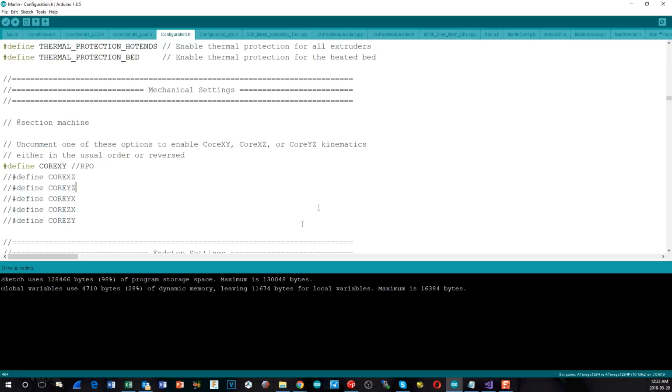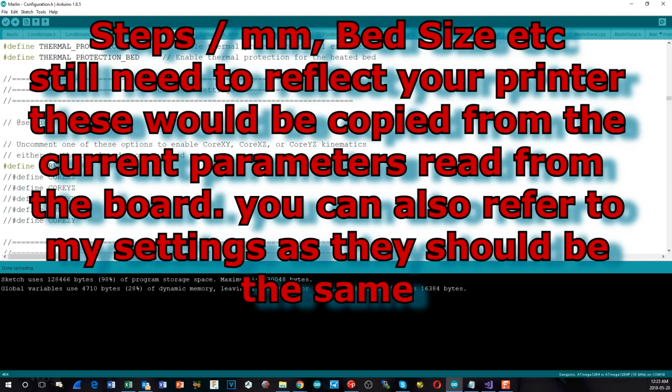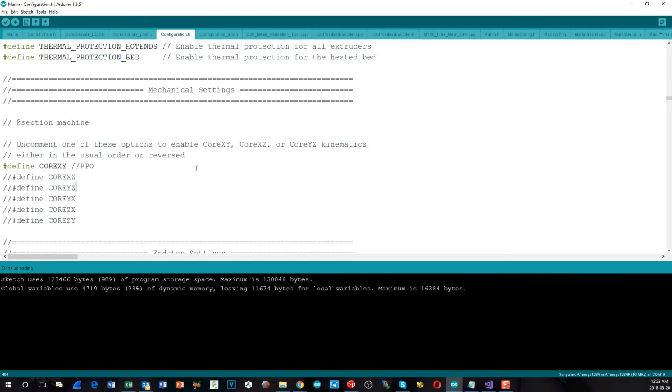In the spreadsheet, I have highlighted a few other properties that I read by going into Pronterface and reading the earlier properties that I had set, or looking at the stock firmware that you can download from GearBest for the TronXY X5S, which is based on Marlin 1.1.6 dev version. So going through those, not a lot of the ones that were changed in there need to be brought forward because the stock Marlin properties will work just fine, I think, in most cases.